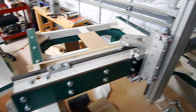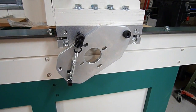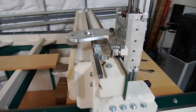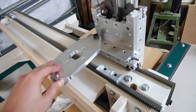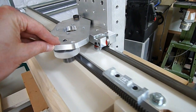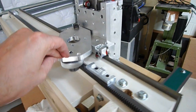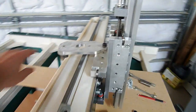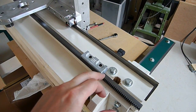This is how it's all going to come together. I went ahead and started fabbing up the rack and pinion systems — covered in an earlier video, it's really no different. The motors still aren't installed, but you can see the spring mechanism up top. This one's a little different because it rides on a horizontal plane rather than a vertical plane. You can see the track facing outward and where the gearing hits. There's going to be a belt around this part connecting to the motor. It's going to be a nice, accurate setup — will make a little bit of noise.